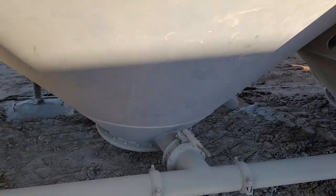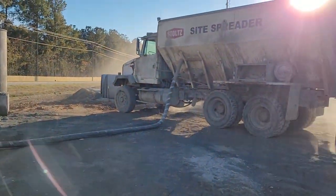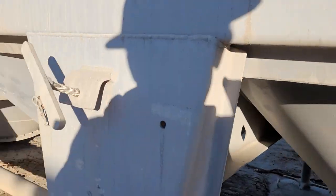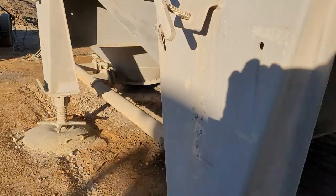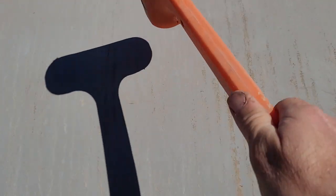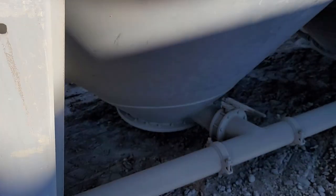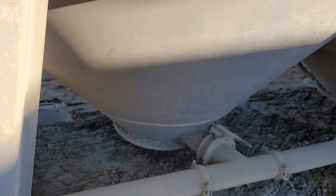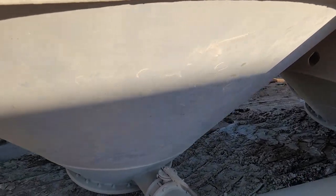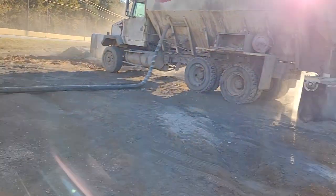You open these valves in the bottle and the air pressure pushes it into the truck. What you do is open a pod and open the one beside it, because as the pod gets empty — there's dividers — the cement starts falling over the side down into the bottom, and it's going to get really slow to empty. It'll purge a lot of air.